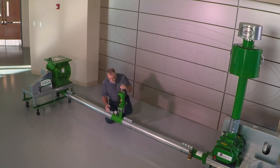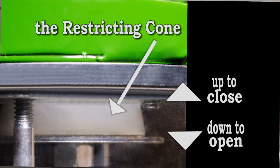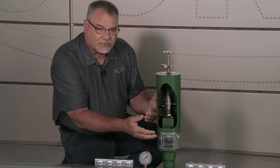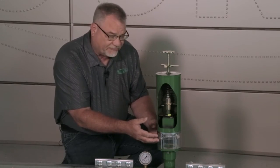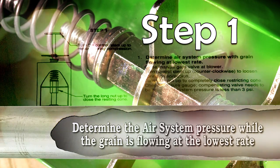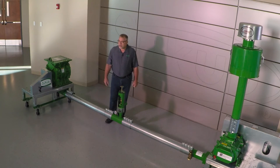Down below, we're going to talk about the restrictor cone. The restrictor cone is the part that has to move up and down — it opens and closes the amount of air that is in the system. By bleeding off air we can reduce the velocity of the grain going through the system, so we need to be able to have the velocity compensating valve set properly in order to automatically do that for you. We're going to set the velocity compensating valve for the minimum amount of grain flow coming out of your dryer.